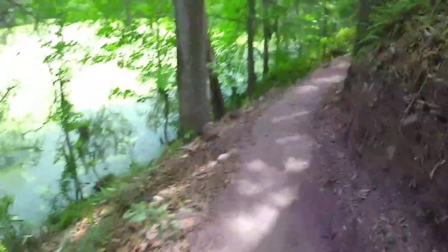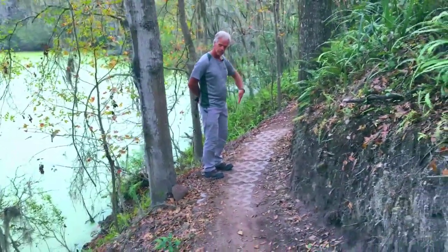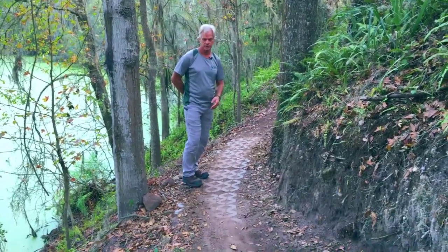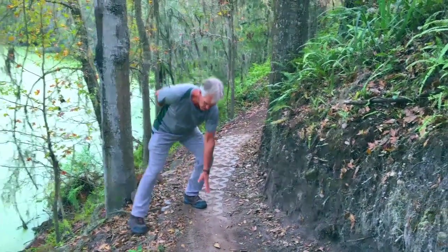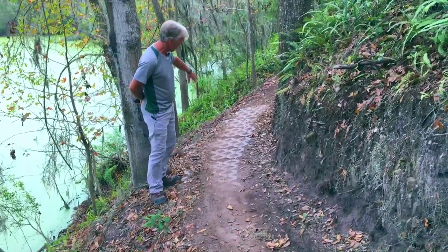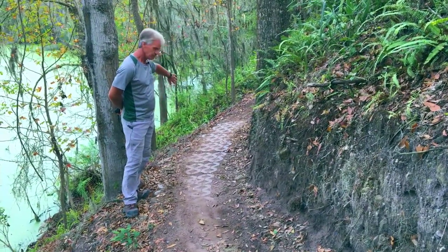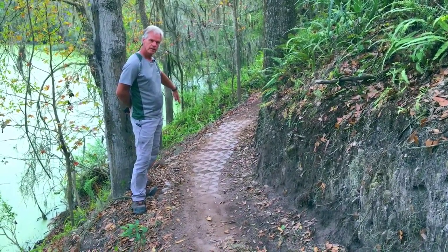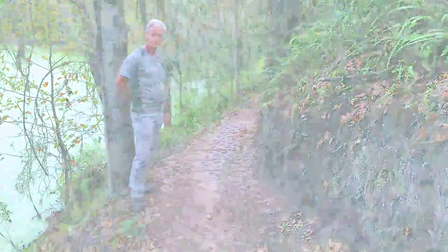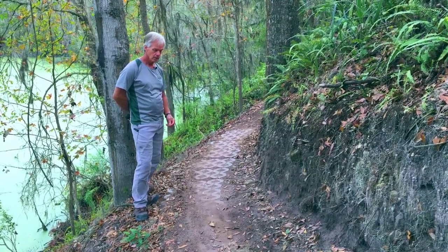This is another technique of armoring right here. The trail should never go in this direction — what happens is the dirt super elevates on the outside, and you get these little piles of dirt up here. You can imagine if those piles of dirt were right along here, there would be a mud puddle on that turn, because all the outside edge would super elevate and water would flow down the hill and stop in the middle of the trail. But if you have to, because there's no other place to route the trail correctly, then we use armoring.